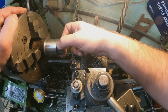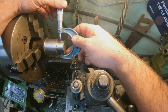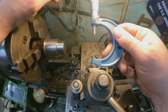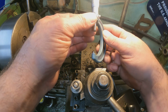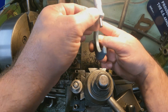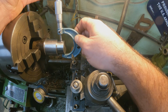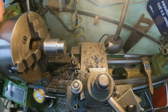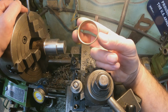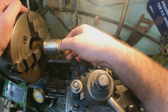Okay, I did some more polish and stuff here, and I got this guy here. If you look, he is 1.375, and he is 1.3750, so it's exactly 1.375 inches, which I'm kind of glad. That's actually what I was shooting for, plus or minus no tenths, 1.375. So here's the actual bushing that goes over top of this, and you can see it goes on fine.